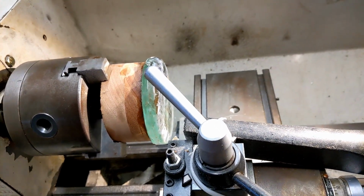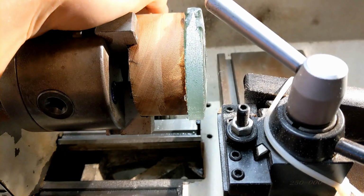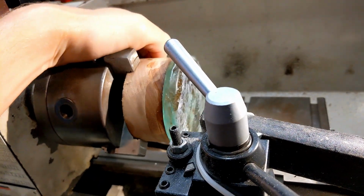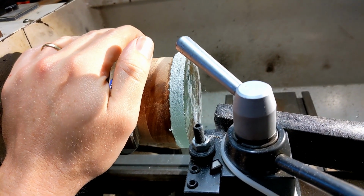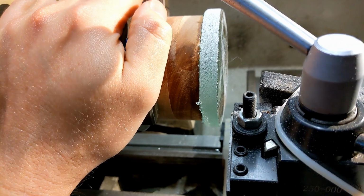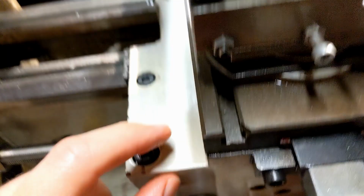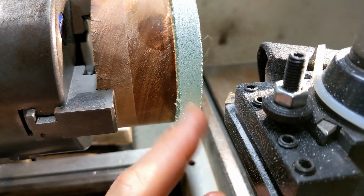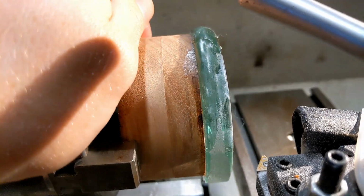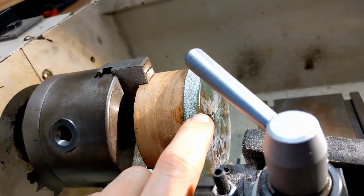Alright, so that's actually been remarkably successful. So I jerry-rigged up this shop vac, and that's as good as I could hope for. So just doing 2 thou passes. Still pretty springy. If I ever went back at the same depth, it would cut again, indicating that it's not doing it clean. But I was just advancing 2 thou every pass, and yeah, it has spat out some slightly bigger chunks. I think that was due to this edge irregularity here. And it did take a chunk out at the join there. That's where it snapped through when we were doing the destructive testing.